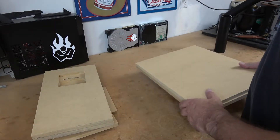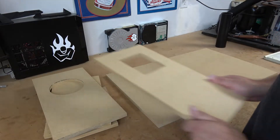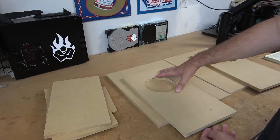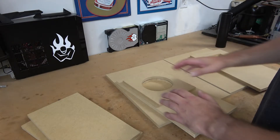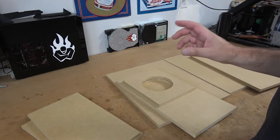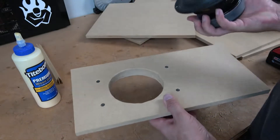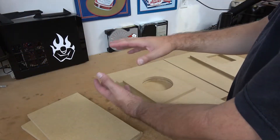For this particular box, it's going to be relatively simple and straightforward. We have two side pieces, our back panel — where our plate amplifier is going to be installed — and our front panel, where our speaker is going to be installed. We have a spacer because the principle of an isobaric enclosure is that the two speakers are working together with a very small air gap in between. I'm going to be setting these up cone to cone, so the cones of the speakers are facing together, and we need that gap so that the surrounds do not touch.